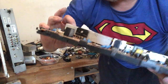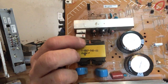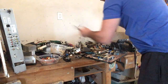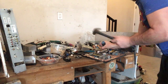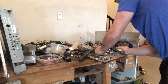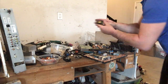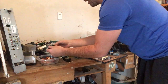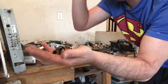This transformer — look, you can see right where my finger is the number two copper in there. Because you can see that nice spool, this is worth opening and taking out that copper. I'm just going to break it off and put it into that donut pile because it too is going to give me copper price. Just peel it up and break it open — there is just a little bit of ferrite on that. Look at that spool — beautiful. I'm going to put that in there. The rest of this outer casing is magnetic — it's ferrite — so I'm going to put it into my tin pile.